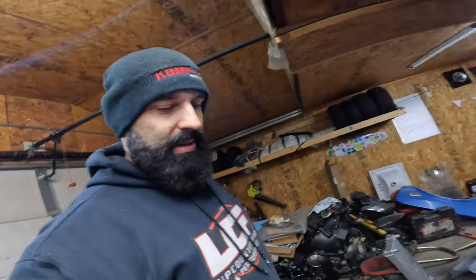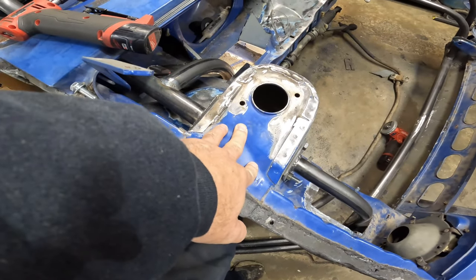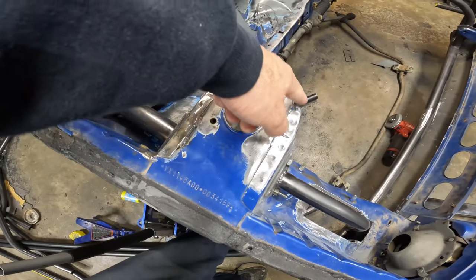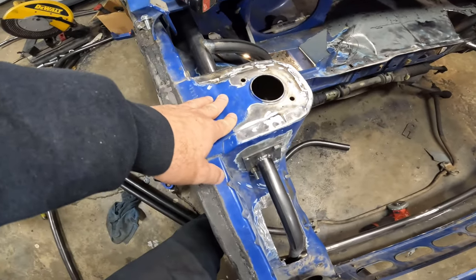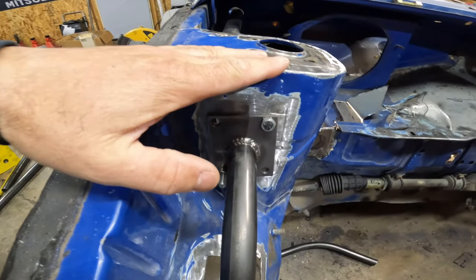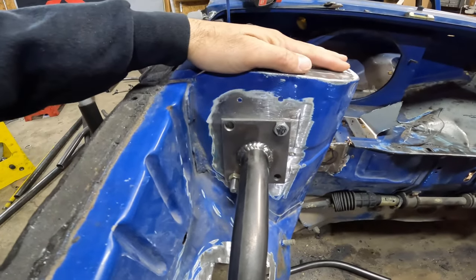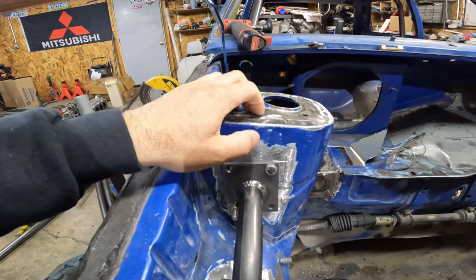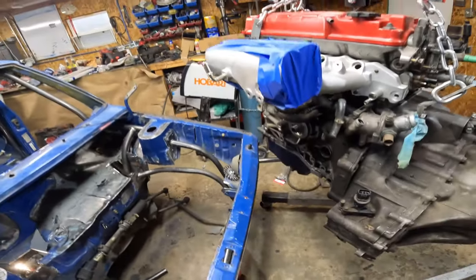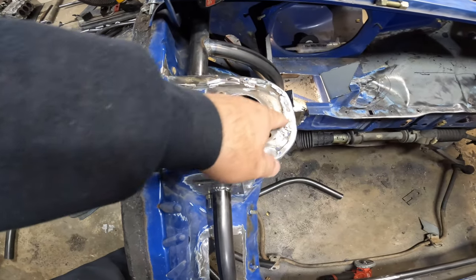We're back. Here's the one thing I gotta do now, just looking at these strut mounts on the car. I think I'm gonna trace it down with the cardboard, make a template, and go cut a 1/4-inch thick plate, sticking out a little bit, and then I'm gonna redo these mounts, get this plate all the way to the top, and then weld that to the top plate that I make, because this is not gonna hold much with the weight of this engine and transmission and whatnot. These usually break even if I brace them, as I was gonna do it.